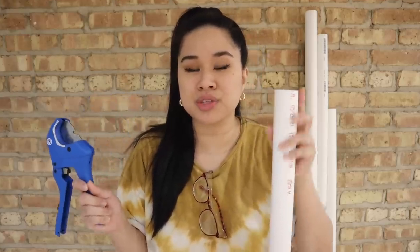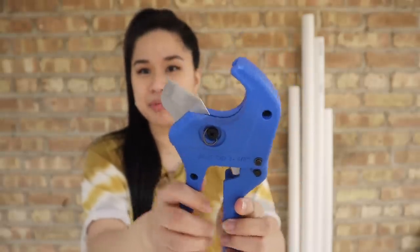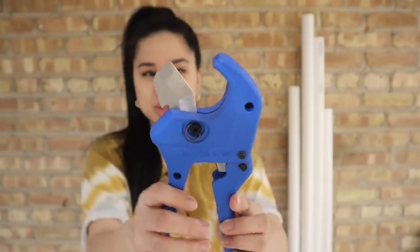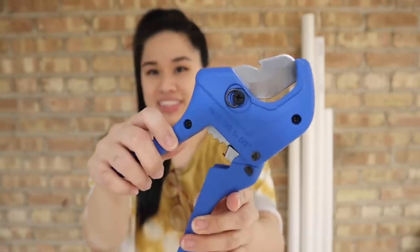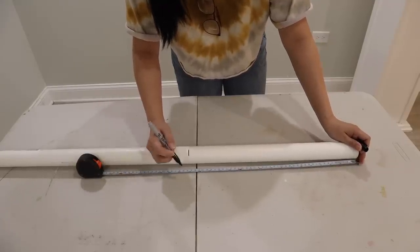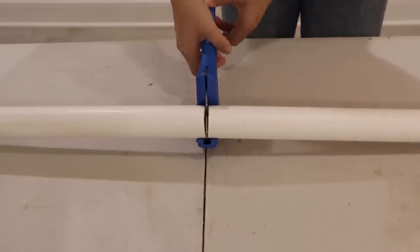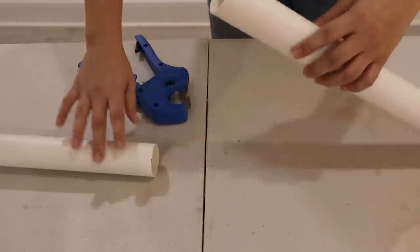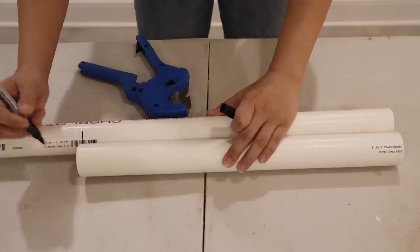Our pipes are secured — I got two of them, so it was about $22. After using the pipe cutter in the parking lot, I found it was really easy to use. Basically every time you press, it closes in closer and closer until it cuts the whole pipe. The height of the wood round I'm using is one inch, so I'm cutting these pipes at 17 inches each to give a total height of 18 inches, which is standard for a side table. One of my goals with this project is to show how you can DIY larger projects with minimal power tools. This pipe cutter was super easy to use at about $13 and is a great alternative to a saw.